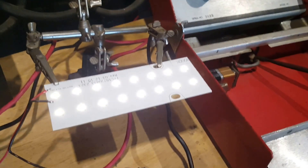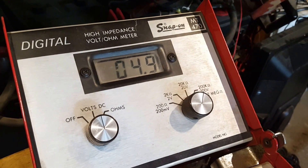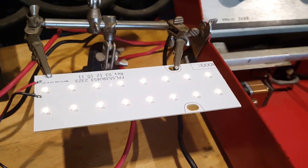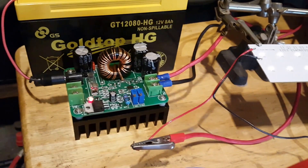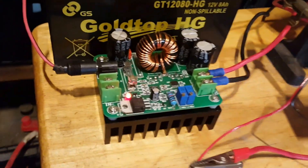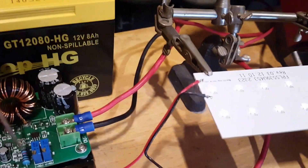I'm going to hook up the converter and see what happens. The LEDs are on and the voltage in the capacitor is going up. As the voltage goes up — meaning the capacitor is getting full — the lights on the LED should get dimmer and dimmer. But because I adjusted the buck converter with no load, I think we need to put more load to get it charged, so I'll adjust the amp a little bit.